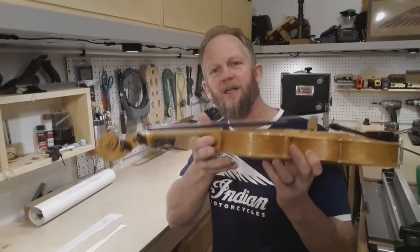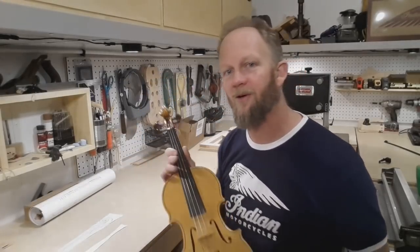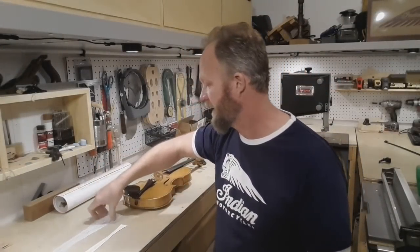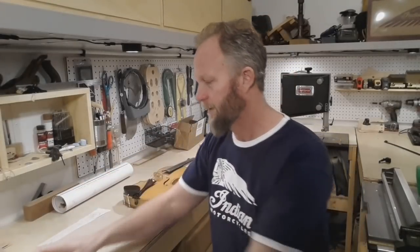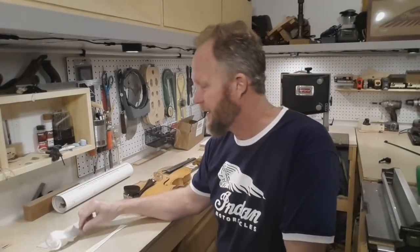We are really going to need two templates to work with: one to give us the profile of the neck and the scroll from the side, and a second one to help us with the three-dimensional head-on view of the scroll itself. If you are working from a Strad poster you'll have a nice drawing of the scroll with dimensions on the back to create your own template — you can do so using a piece of paper, or maybe download and print one, and transfer it onto your wood using carbon paper. Maybe you've got a hard template — these are nice and you just trace around it.